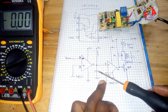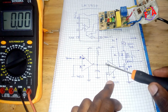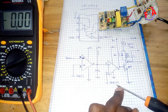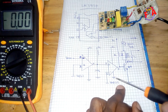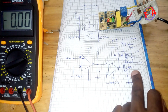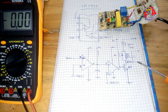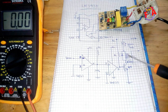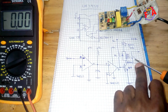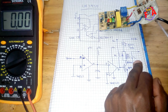This capacitor will charge exponentially, starting on zero volts, and the voltage will increase. After about one minute, it will reach V reference 2. Once it becomes greater than V reference 2, the output will be high — this transistor will get power, its base is getting biased, so this coil will be energized and this relay will close contacts. Normally open will be closed, normally closed will be open. So now our load will get power.